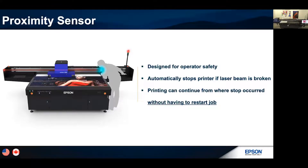We also have a proximity sensor. Everybody has a tendency when printing to stick their head inside and look at the image to see the quality right away — but you don't want to get hit by the carriage. The proximity sensor is an invisible laser that goes across from one part of the gantry to the other, helping prevent any kind of serious harm. Just like the jam detection feature, if your arm accidentally breaks the sensor and the print stops, you just hit resume, keep going, and you didn't lose your material, your time, or your print.